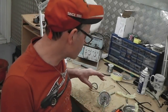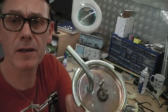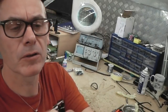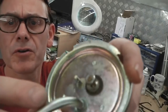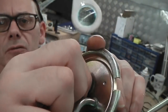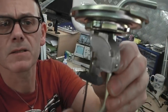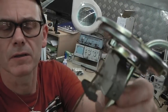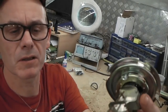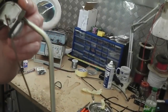while that paint dries on those pods, we've got ourselves the fuel sender, nicely galvanised fuel tank sender then. Little isolating rubber collar goes on the mount stud first, and then a fibre washer, and then a final washer, then this nut of unknown size. We bolt that back together, took that off to get this galvanised, left that. Now we can connect this up to the gauge and check that the gauge is calibrated, seeing that we've messed with the gauge with the paddles.